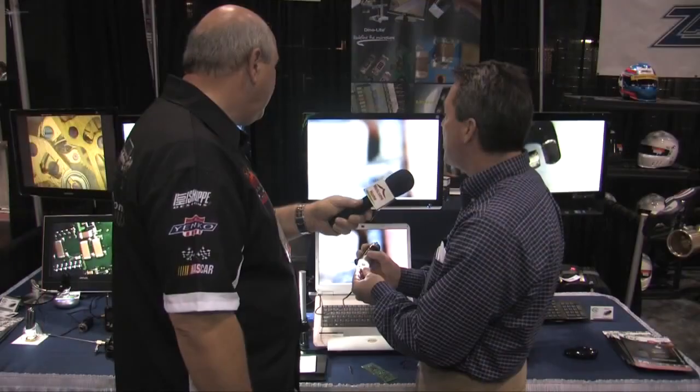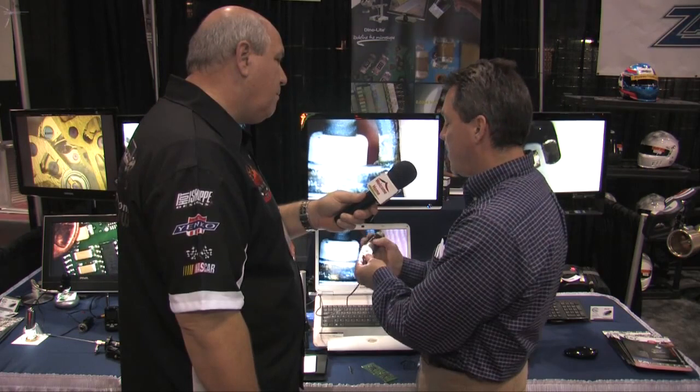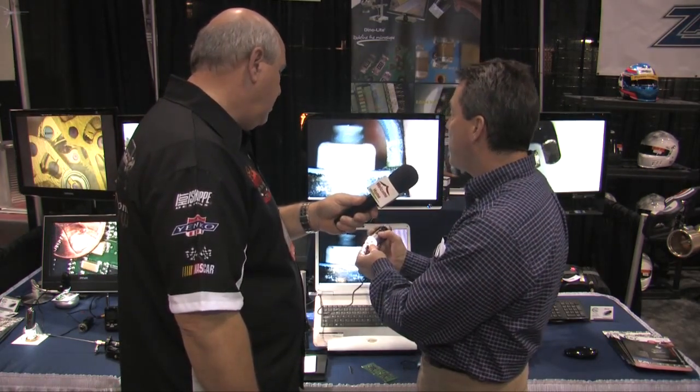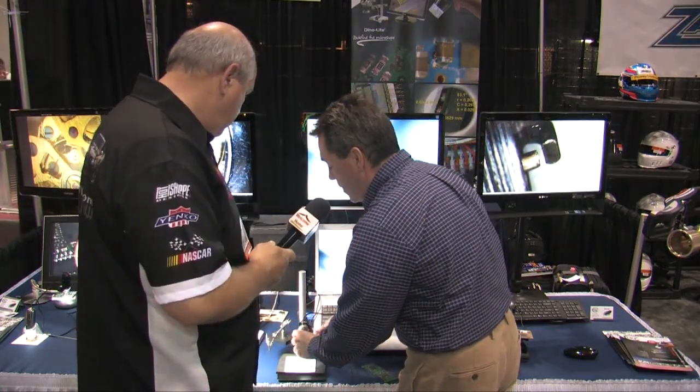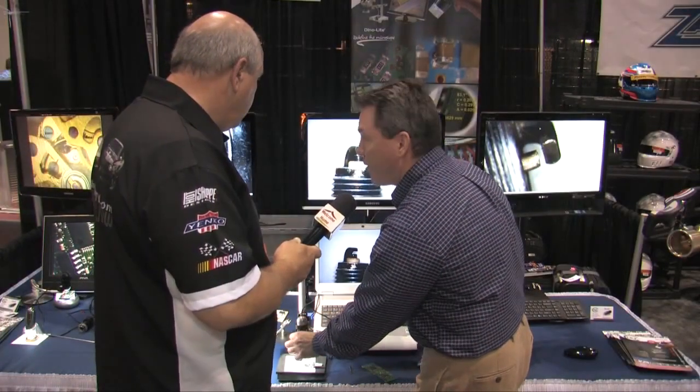This is a variable magnifying device, and at this particular working distance I can actually get a little closer. I manually focus by turning this dial — it'll go out of focus for a second but it will come back in. Now we're looking at over 200x magnification. If I back it off, now I'm getting probably 50x right around there. You can control exactly how much magnification you need. The working distance factor begins inside the scope, so at this particular distance it will come into focus twice — that's where we get our higher magnifications. To get a larger field of view and less magnification, simply increase the working distance and refocus. And there you have it — this is a consistent characteristic of all of our scopes.